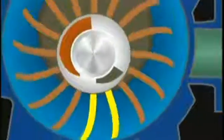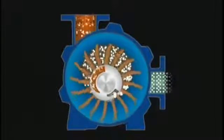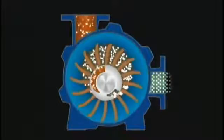When connected to your system, the vacuum created in the pump draws the gas through the inlet port of the cone, filling the chambers which move past the port, trapping the gas. As the body wall converges, liquid is forced back into the chamber, compressing the gas and expelling it out the discharge port as the chambers rotate over it.